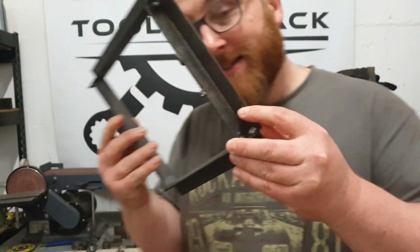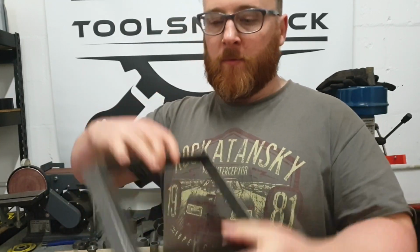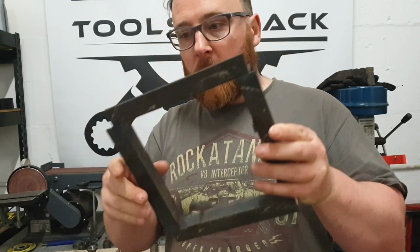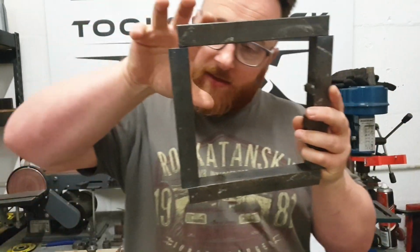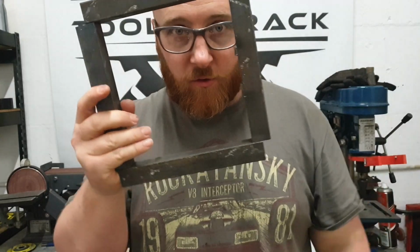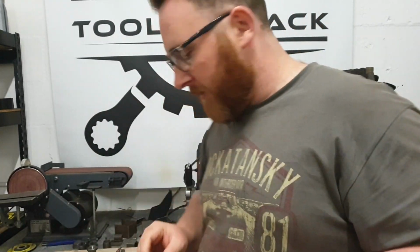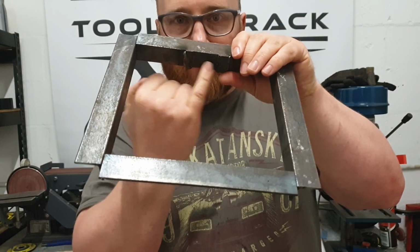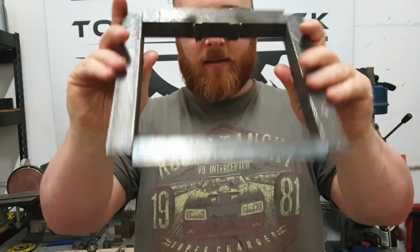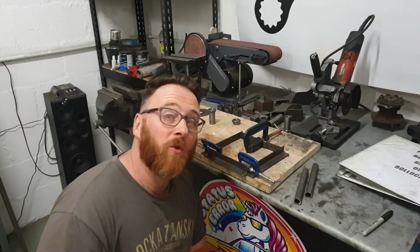Yes, this jig is simplicity in its finest form. It is just inch by inch angle iron, which I've set out to those measurements and welded perfectly square. That will give us fixed outer references that I can clamp all the individual components to and make sure they don't move. But I hear you ask, what about the clamped component that needs to go in the middle, the camber adjuster? Well, we've welded on a pair of tabs exactly in the middle, which will locate that so it doesn't bugger off.